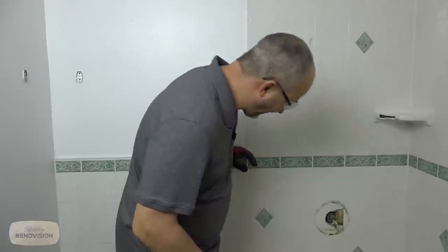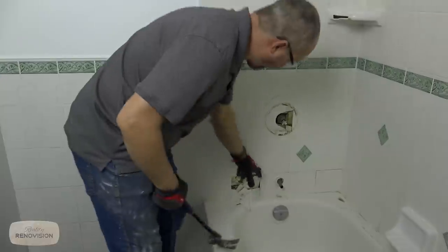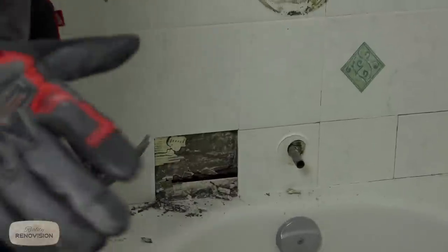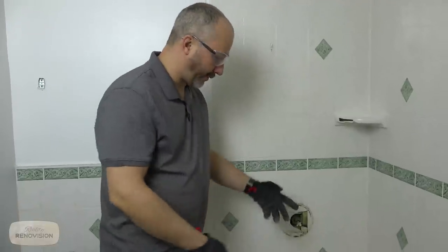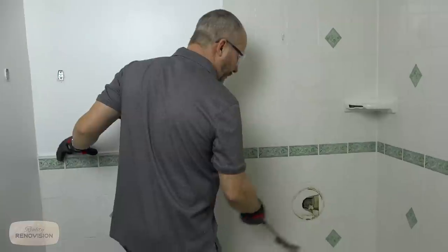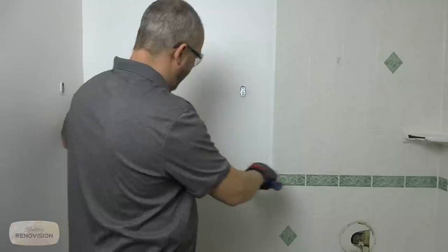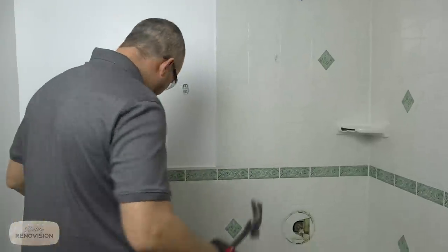We're going to come back and do the surgery for removal of the rest of these walls. You can see there's just nothing behind this — it is absolutely just rot. I know that 95% of old homes out there, if you have a bathtub and you have mold, that's what your wall is — it's just dust. You need to rebuild them. We're going to be real careful because we have all the water supply lines for all three stories going through this wall. We want to cut this wall in half using a hammer, break through the tile, and open it up like a big panel, one panel at a time.